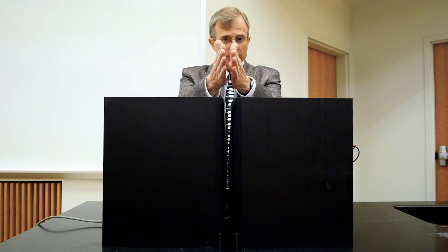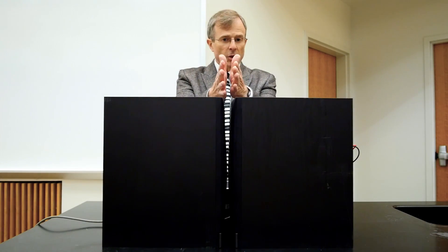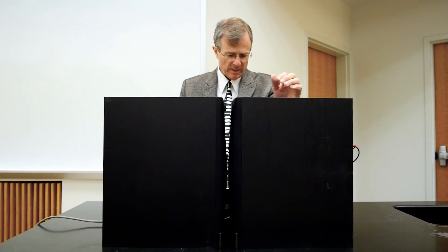I've got two speakers that are actually facing each other, so their cones are vibrating this way. I've connected up the speakers correctly so that both speakers are in phase, meaning that the same signal fed to both speakers causes this speaker to move out at the same time that this speaker moves out. So they're moving toward each other and then away from each other, and that causes large compressions and rarefactions and a loud sound to be emitted. This is a 100 hertz sound, 100 cycles per second, produced with these two speakers oscillating in phase.